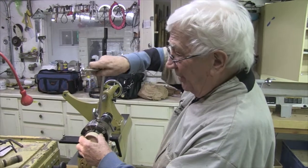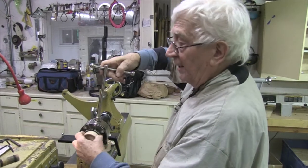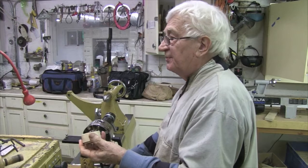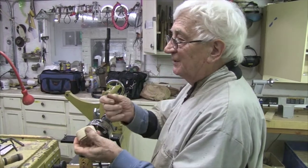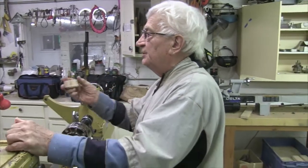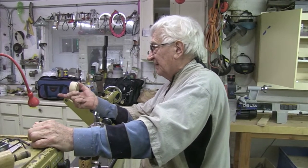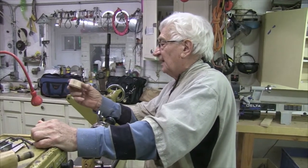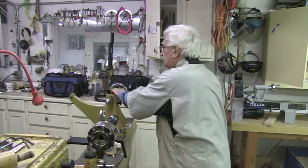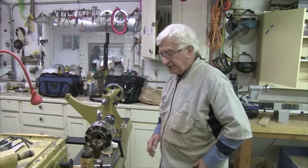Now, normally, we did this a little different way than I normally do it. I would cut any size I wanted, just cut it for the inside threads, and then mic it with calipers. And there's a formula for it: 1.20 millimeters added to it is what you do for the outside thread. But you can see these threads, they're pretty darn good in a piece of hard maple.